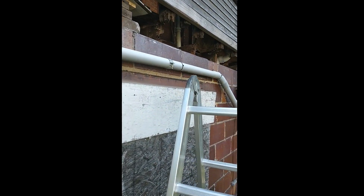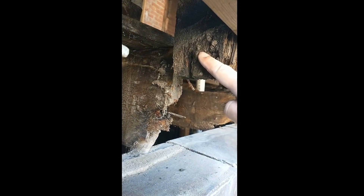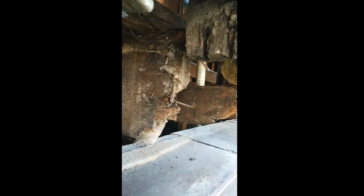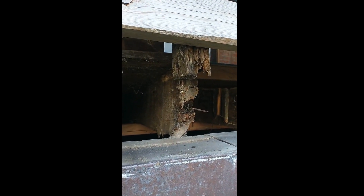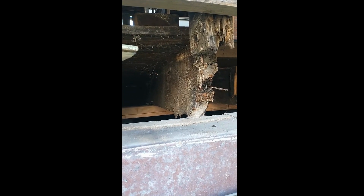I'm going to climb up here on the ladder and show you. So you can see at the top here — that's a wall stud, and that is the floor joist holding up the floor. And because this building is balloon-framed, those are not connected to each other. They're near each other — they both originally connected into the sill. So I had to lift the wall separately from the floor. I haven't actually lifted the floor yet, but you can see down in the basement there, I've got a beam with some jacks underneath it. So when it comes time to put the new sill in, I'll get the floor jacked up so it's at the right level.